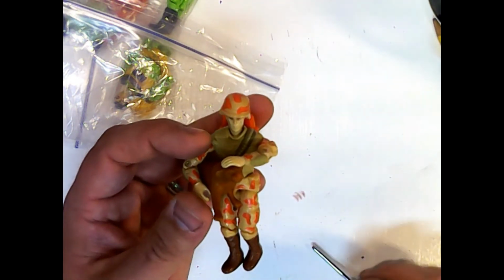All right. So with that, hopefully that helps you out on how to replace these Joes. Again, you can find T-bars and screws on eBay, and they usually have them selling out of China. I was going to order a couple extra sets. However, right now I'm kind of waiting with everything that's going on in the world. But the O-rings you can actually pick up at Home Depot. Those O-rings I get are the Danco number 10 O-rings. I get the thicker ones because I feel like they hold up a little bit better on the Joes. The smaller number 8s and number 9s are going to be a little bit tighter fit, but the thicker ones I think hold up just a little bit better over time.